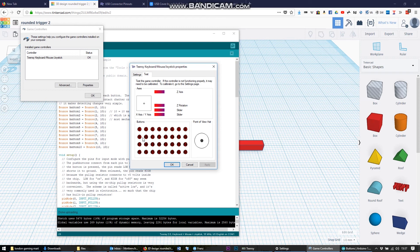So that's how far we've got with the Game Gear — the buttons are wired. The next step is going to be integrating the power board from the Game Gear so it can power the Raspberry Pi, and that's going to involve having a soft switch. So when you turn off the Game Gear, the Raspberry Pi goes into shutdown mode — it doesn't immediately just power off. I think I need a couple of five volt regulators to get it to work the way I think it will.